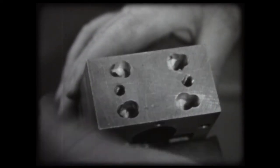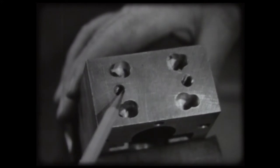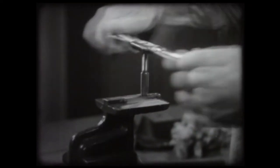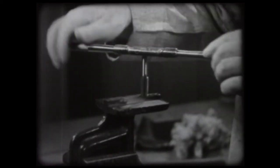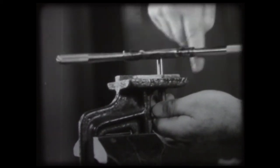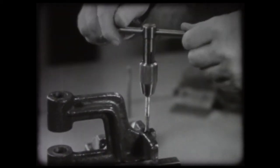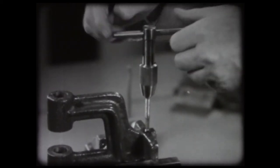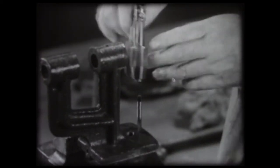This job is completed. Depth of the thread should be one and a half times the diameter of the bolt, to provide a good, strong connection. This is a through hole and larger hole, but the same care and procedures are used in threading it. The one exception is that in through holes, the taper tap may be the only one used — the plug and bottoming taps may not be required. Another type of wrench for holding taps is the T-handled wrench, often used for the smaller taps and to extend the length of the tap shank. The one-end wrench is used in corners or where a full turn is impossible.